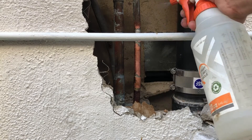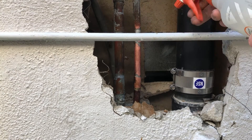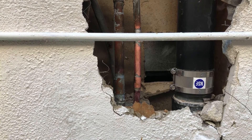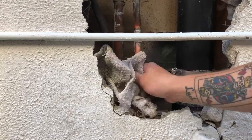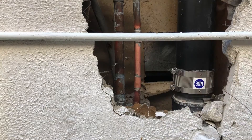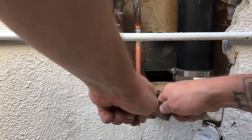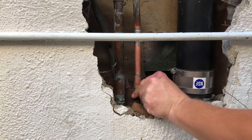After soldering, you're going to want to thoroughly clean the pipe and wipe it down really well. If it's going to be exposed to the elements, spray a little bit of WD-40 on it and wipe it down again. Make sure there's no flux left on the pipe — that stuff is very corrosive. It'll turn the pipe green, and if anybody sees flux dripped all over a pipe that wasn't cleaned, they're going to say 'who the heck did that?' Hopefully if you're a good plumber, you don't want that to be you.